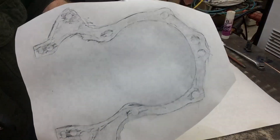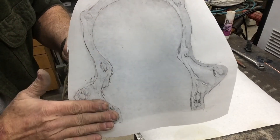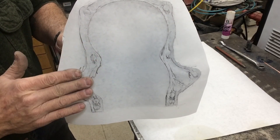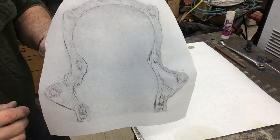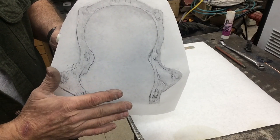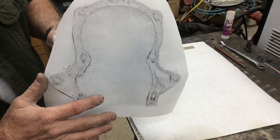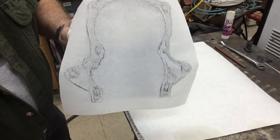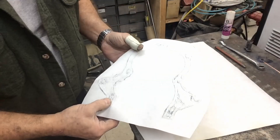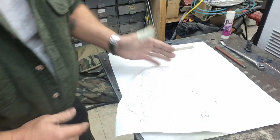There's the bottom pattern — that will be the block side of the base piece for the fifth bearing. We'll probably start off with a piece of half-inch wood. I'm not going to do a proper pattern for this — a proper pattern would be solid wood sectioned out and spliced together for maximum strength, with grain oriented for stability. This will probably just be a plywood or hardboard pattern, because this is not going to be a production piece. We only need to make three or four castings — we'll probably mess up one or two machining them, so that's all this pattern will ever do.